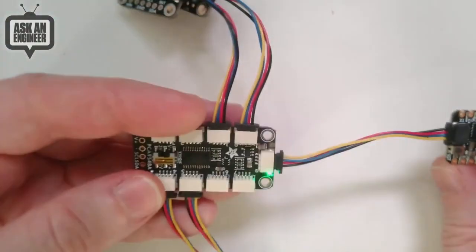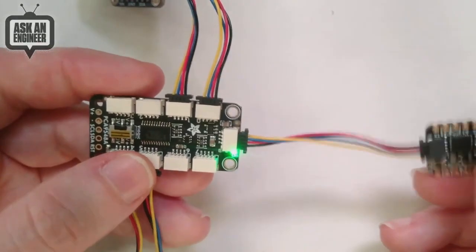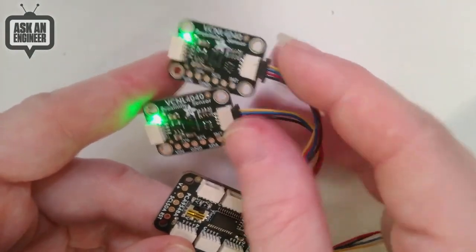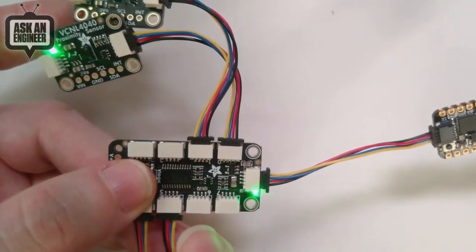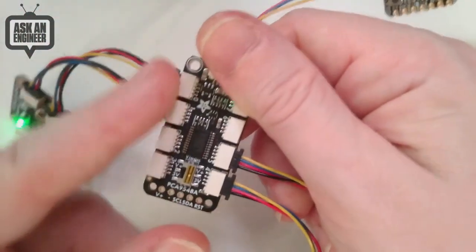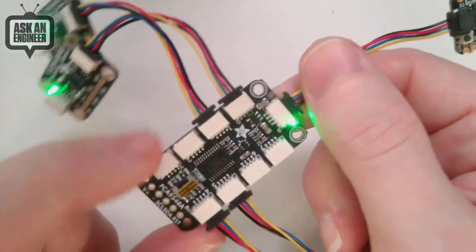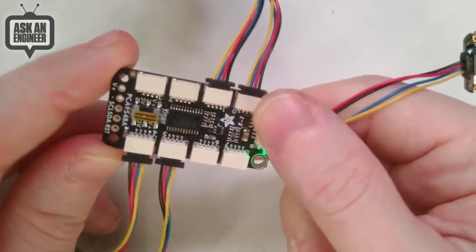It has LEDs, so you know everything's lit. If you're using a 5-volt Arduino with STEMMA QT, you might want to level shift the output. All of our boards have level shifters on them, but if you're using Qwiic or you made a DIY design, you might want to have 3-volt power and logic. So on board, there is a 3-volt regulator with 500 milliamps output, and a level shifter. And then down here is a little switch that lets you select the logic output for these 8 ports. So even if this port's 5 volts, you can select these to be 3 volts just by flicking the switch back and forth. And this is 3 volts already, so you're not going to see any difference. But we had a little bit of space left over, so I thought, why not add a level shifter?